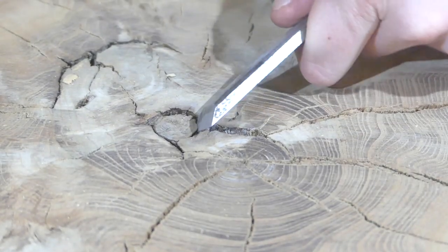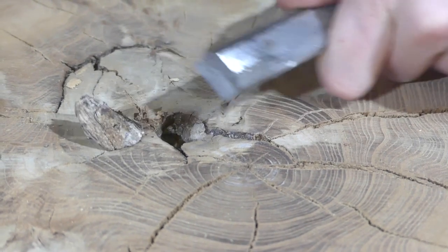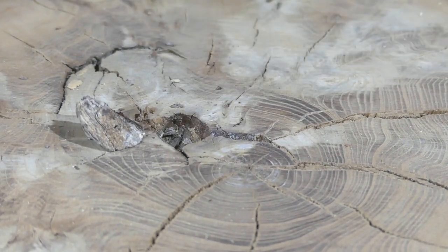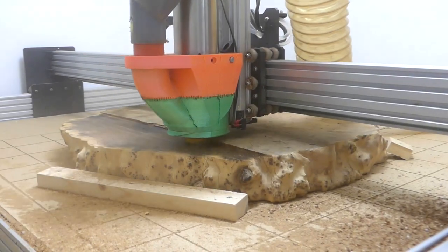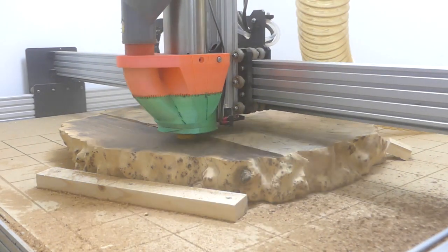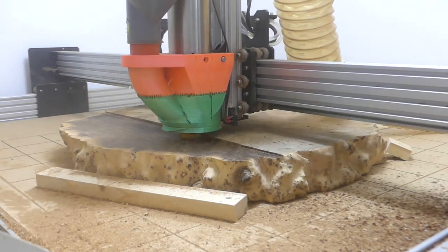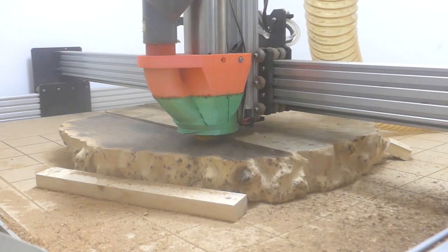During the cleanup, I had to remove a knot because it would have floated over the epoxy and probably caused a few bits and pieces of wood to float underneath it, giving bad results after planing and sanding, which was a shame really because it could have looked really nice. As you can see, the slice itself wasn't exactly straight, so I knew I had to remove a lot of material, hence the previous decision.